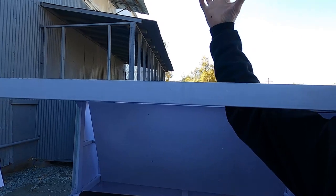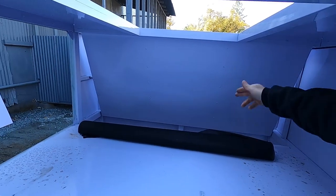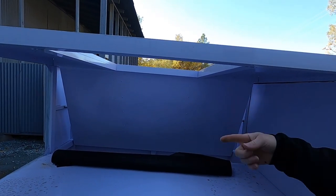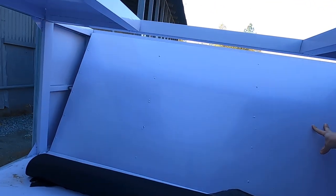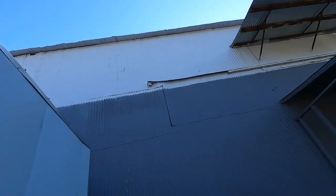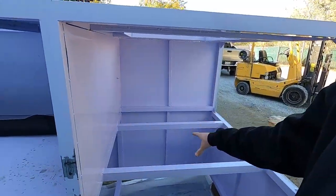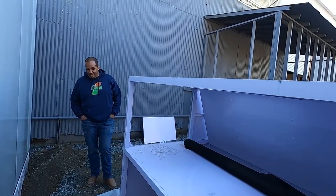They blow right into the booth. We have a louver in the back — as it sits now, it'll be sucking air from the bottom of the booth, coming through the fans, and blowing right back in. This is just circulation — I believe it's for when a car is baking. When the louver changes direction, it sucks fresh air from outside in, and then the big motor pulls that air back out. Sounds like that diagram I sent you last night.